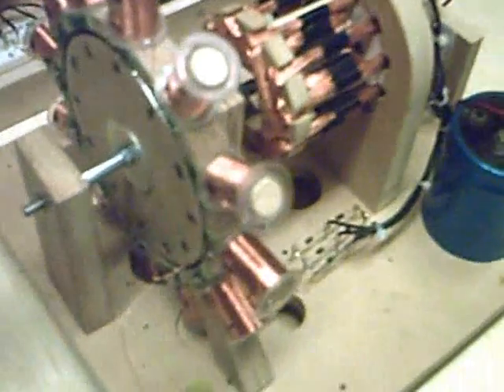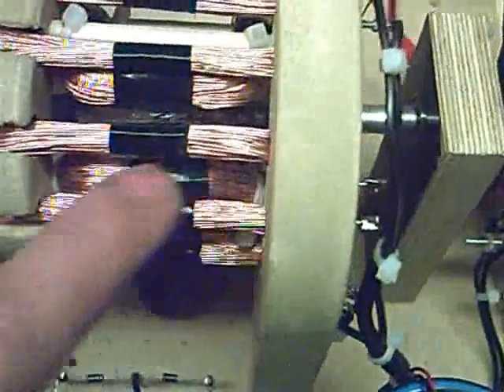Something a little bit different. This is all fully recycled from my first Bedini type pulse motor that I actually put on YouTube. So the first one — this is the bits left out of it. That's the parrot cage generator that someone named it. But inside, if you can actually see those other two sets of coils, is another generating system. We're actually using it as a motor rather than a generator. It's actually the copper wire off the same setup that this came off, and I've just unwound them all and rewound them inside there.